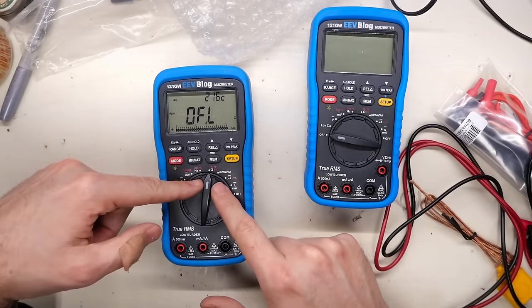Now, I fully expected this SID for the shortboard to work. They're extremely reliable, well, compared to 6581s. In fact, this entire motherboard design is also extremely reliable. So as I've kind of gone on a kick of what you should buy if you're looking to get into something, you should probably look for a Commodore 64 that has the shortboard or the smaller motherboard in it. It's just gonna be more reliable. Not like they're totally trouble-free. It just has a lot less of the typical failures like bad ROM chips and bad PLA chips and bad SID chips that afflict the longboard versions that are in all the earlier bread bins.